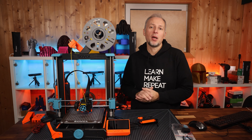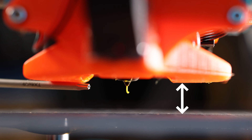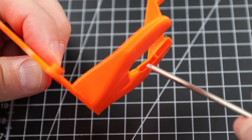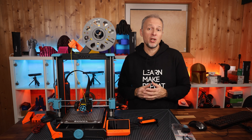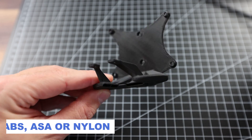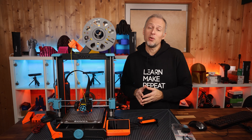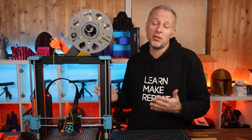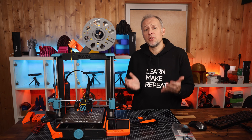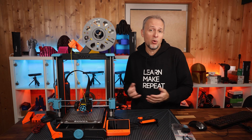I can highly recommend doing these two modifications first. However, one caveat about the hotend shroud upgrade is that the shroud sits very close to the print surface, which makes it very effective, but it has already started sagging a bit because I printed a lot of PETG parts using a higher bed temperature. So I would personally recommend getting this part printed in ABS, ASA or Nylon, which would not warp so quickly — probably not on the SV06 unless you have an enclosure. Just these two upgrades cost basically 20 to 30 dollars or euros for the fans and make this printer 100% better than before.